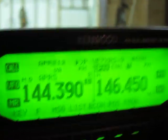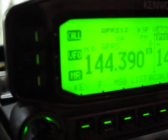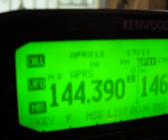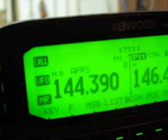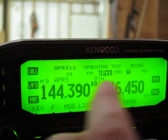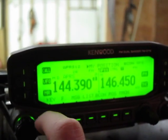Once you have that set up, we should be able to start working on setting up APRS. You'll notice first of all, this is my main screen. APRS runs on 144.390, and that is what most APRS signals go. I have it set up on the left side with APRS 12 and the TNC turned on. A major problem that people have had in the past with APRS not working is because the TNC is not turned on. If TNC is not turned on, nothing will work. When you turn the TNC on, you'll see APRS 12 up here, opening TNC, and you'll see your beacon and your GPS.